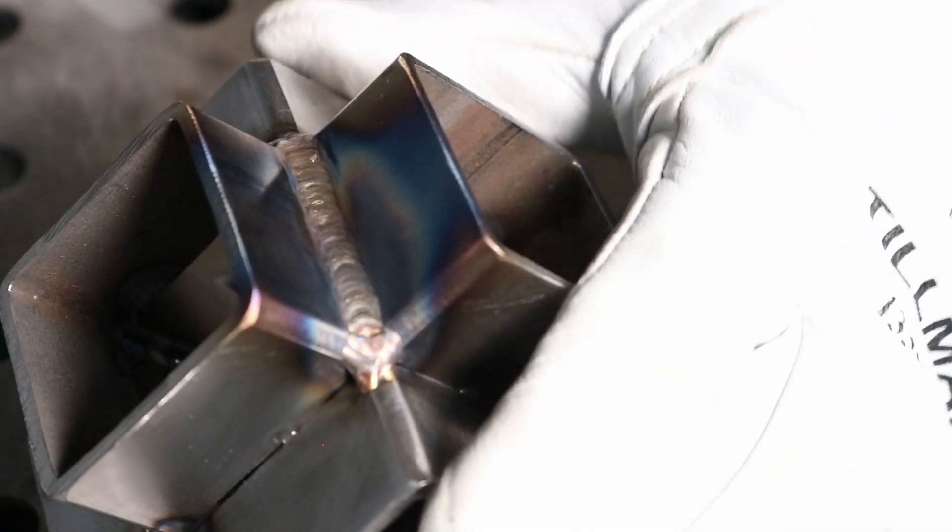Let's see if we can't get a little bit better every time. Here I'm going to go off the pulse settings and go ahead and dab. I'm heating up that tack at the corners until it melts and I get a pool. Once I do, you can see I'm using a little bit of a forward and back motion — I'll pull my filler rod out and advance forward. Here's a different view. That pushes the puddle, then I add filler to that puddle while I pull the torch back, so I avoid getting up in there and melting the filler before I get right into the puddle. Let's take a look — you can see it looks pretty good. I'll go ahead and brush it off a little just to brighten it up. Not too bad.